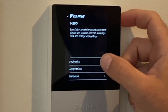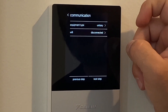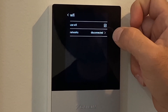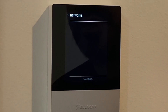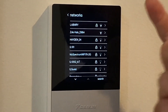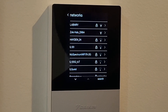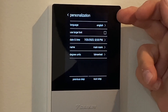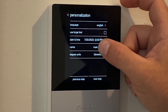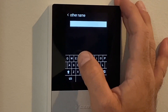Setup menu, begin setup. Communication: unitary. Wi-Fi is disconnected — let's select Wi-Fi and search for networks. In the customer's home you'd see a full-bars network, but we're not seeing one here, so the customer likely doesn't have internet yet and we can't update the thermostat software. Go back, next step. Language: English. Date and time will automatically set once connected to Wi-Fi. Name the thermostat appropriately — our customer is Brandon Long, so we'll enter 'Long.'